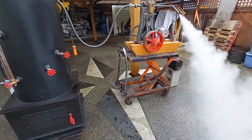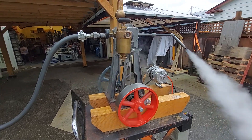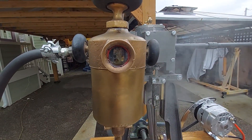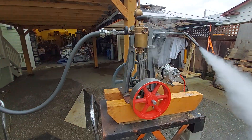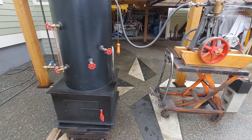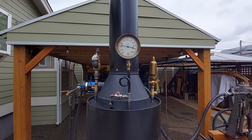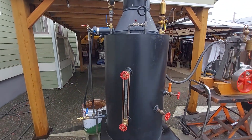It's a beautiful engine — it runs really smooth. So it's drawing oil now from the oiler; you can see it dripping in there. The engine only needs a little bit of oil — I'll fill that with oil before I ship it as well. That's about where the engine will run depending on how hot your fire is and how cold or warm it is outside.